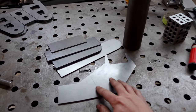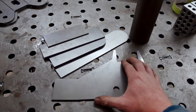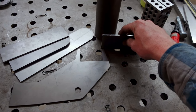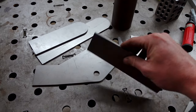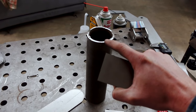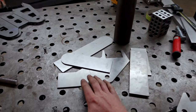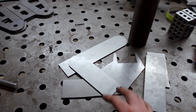We got our feet wet — I'm ready to tackle the front lower mounts. I think these are going to be the toughest part of the whole thing. There are a lot of pieces: two main side shapes, lots of pieces that need to be bent to shape, and then we've also got to take this tube, cut it up, and machine it to the right length — it's going to be our end piece. There's a lot that goes into this bottom mount, so let's head over to the brake, bend these up, and try to get them all to shape.